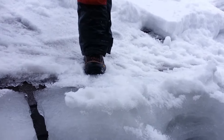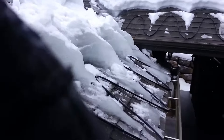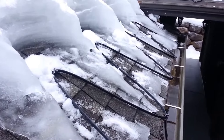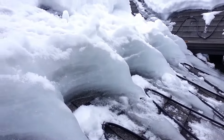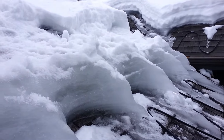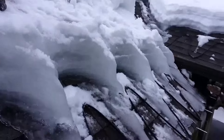So this block of ice has formed across here and water cannot escape through the ice. It ends up going up under the shingles and back in. If you look at this — we've cleared the gutter, we've cleared the roof edge — yet if ice still forms on your roof, you're still going to get a potential water leak into the house.